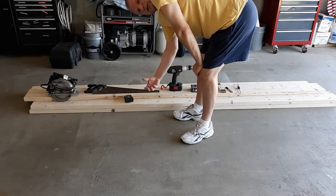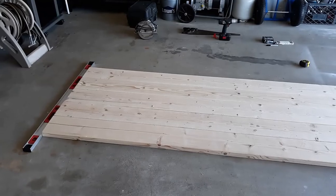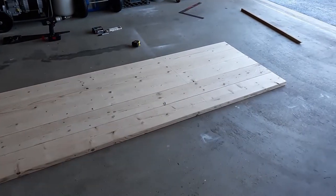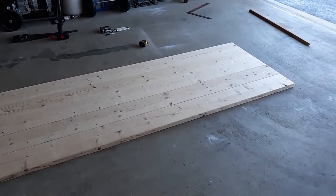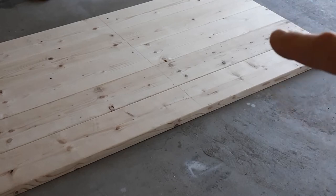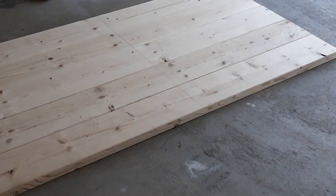I'm going to try to edit this video as short as possible because I know a lot of people don't like to sit and watch a long video. So we laid out our boards face down — you want the good-looking part of the board that you want on the top of your table facing down. We're building this in reverse. Got a straight edge down there, lining our boards up, and I've laid out a mark over here. You can see those are my cut ends, and those are going to be the stringers that run lengthwise to tie everything together.